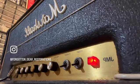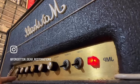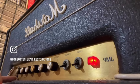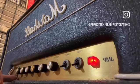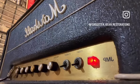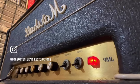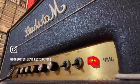After revising the grounding scheme on the control panel and properly isolating the jacks and doing a couple other minor things, I was able to not only reduce the background noise, but also the onset of any oscillation, which I believe at this point is just a function of which pickups and your proximity to the amp.